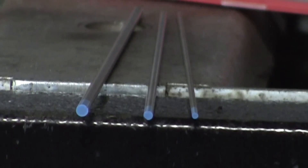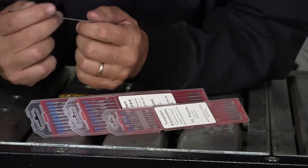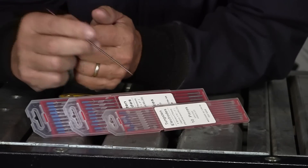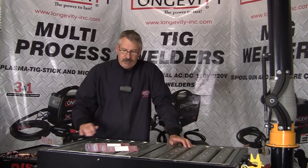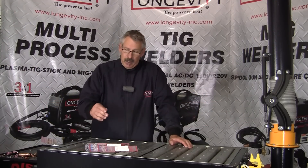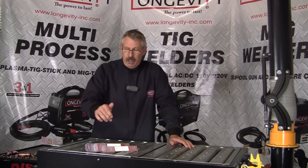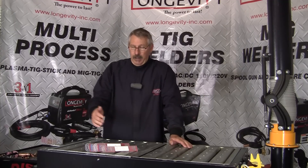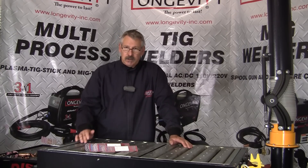The length of these is 175 millimeters, or about 7 inches. I can't tell you exactly what tungsten diameter is going to be right for you — you have to experiment and figure out what works for your purposes. Don't be afraid to experiment: get some scrap metal, use different diameters, and see what their limits are. My estimates here are strictly ballpark. If you can weld everything you need with a 1/16", then fine, use it. But when you get into heavier materials and surpass electrode limits, you'll wear them out unless you go to a larger size. Conversely, for smaller materials, go down in electrode size for a smaller arc pattern, which will help your welding.